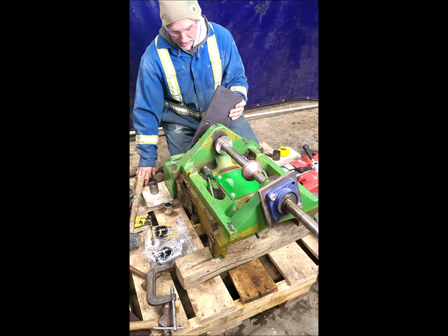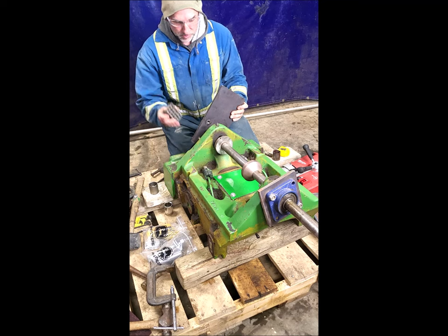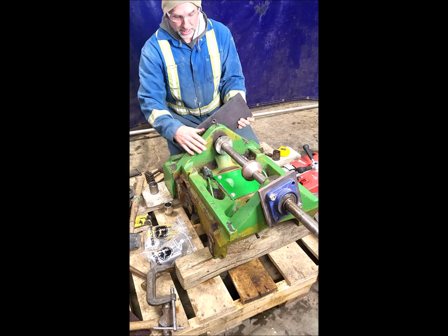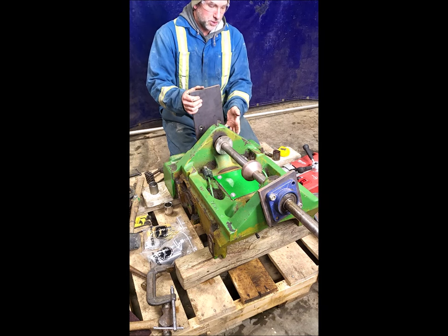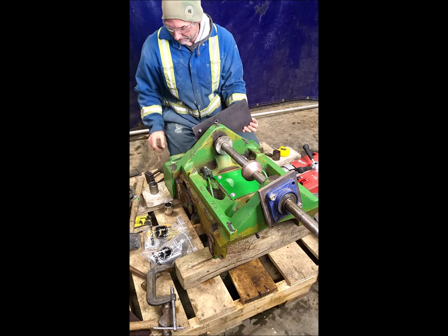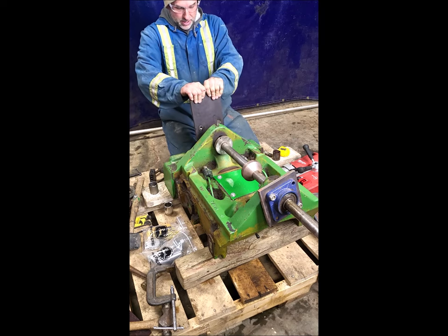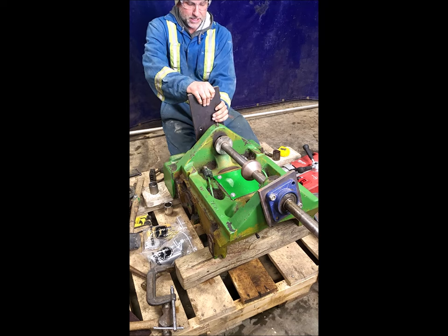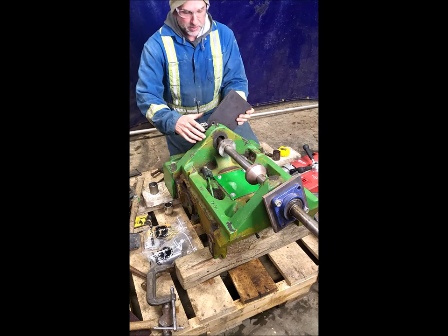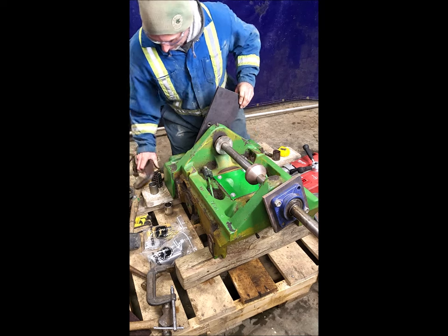What I had planned was there's a machined surface on this side that runs perpendicular to this bore. So I'll just use some 1-2-3 blocks and bolt this plate that holds the flange to the housing. I don't want to do any welding - normally you'd weld your bearing housing to whatever you're line boring, but I don't like welding to this cast if I can help it. So we'll bore this on. These bearings oscillate, so they're essentially self-aligning, and you can get it very close. Let's get these guys installed.